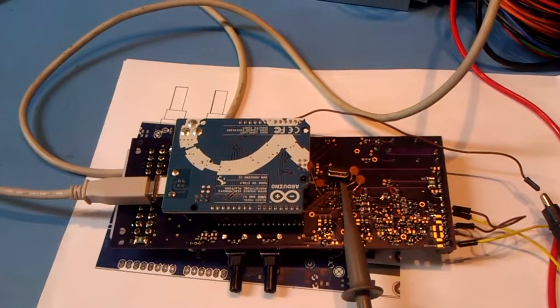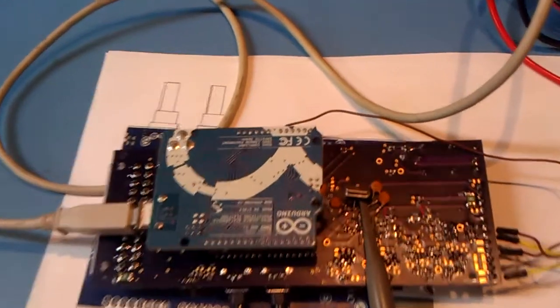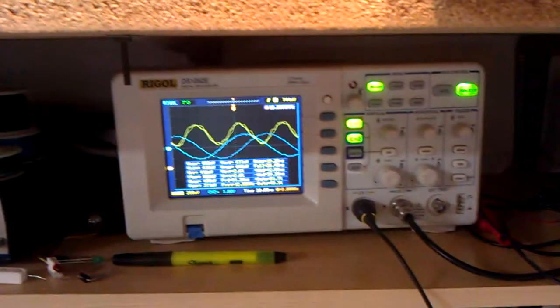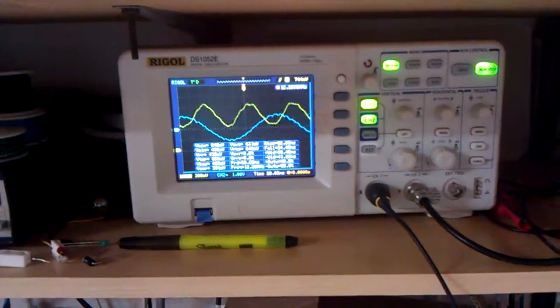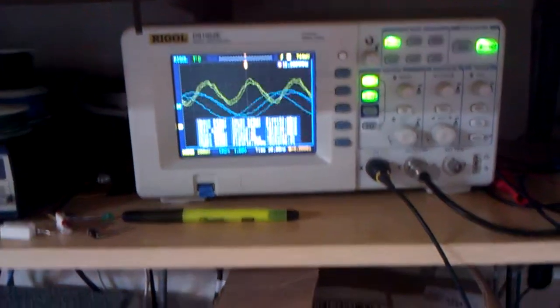so I'm hoping that I'll be able to start getting values out of my ADC. I can write configuration. I believe I'm writing a divider of divide by 4, which on this 12 megahertz crystal should give me 3 megahertz, which is between the 1 to 4 that the part calls for. So hopefully that'll be good, and I'll see you guys later.